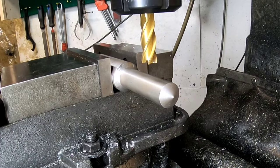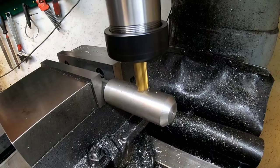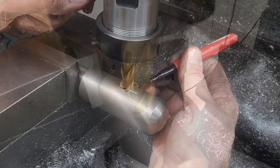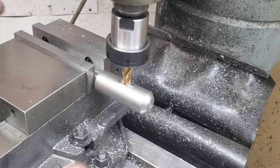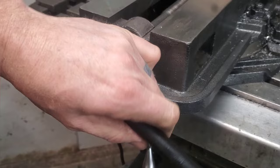Here's a good example of how I find center on a shaft if I'm cutting a keyway or a flat. I actually cut a light mark across the top — just a little flat where I'm going to line up the cutters. The premise is you have a two-flute or four-flute cutter with exactly even cutters. The line you've cut is going to line up with one corner of the tool bit, and if that corner lines up with the opposite corner, you're at center. With a really small piece of steel and a small cutter the error is more pronounced, but the bigger the diameter and the bigger the cutter, the more clearly you'll see and be able to correct that error.